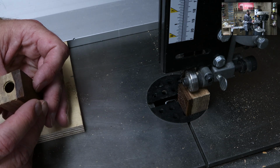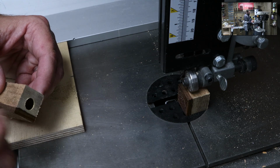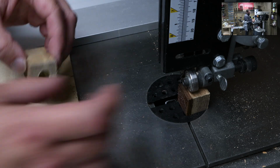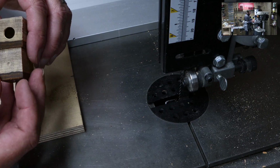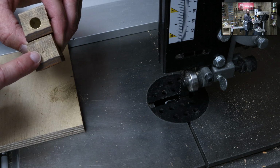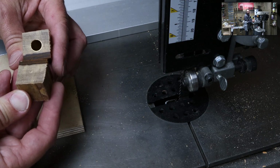Okay, so that's the first top tip: we can drill our blank on the lathe, measure the distance of that tube and only drill in that distance, and then we can cut off any little remaining bits at the end. And you can see how close we've got that. You can just see the little spur of the drill bit has engaged on that face there. Okay, good.